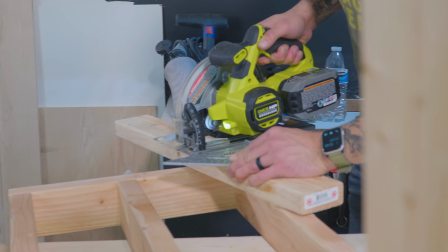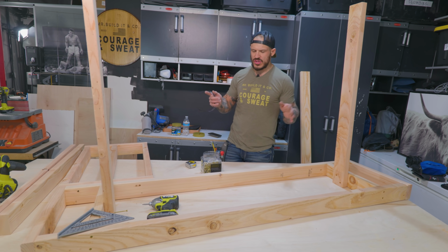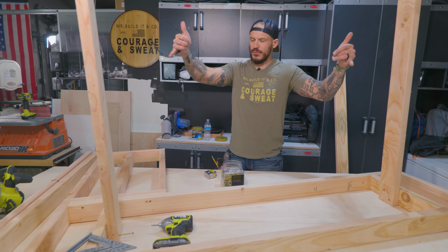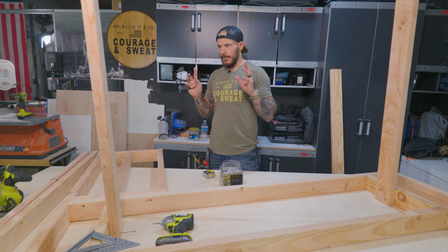This is the base, 6 feet long, 4 feet wide. The inset for your knees, about 8 to 10 inches. I'm going with 9, splitting it down the middle. Gonna build this base, put some posts up to 42 inches tall, and then reinforce it, and then we're gonna wrap it with 1/2 inch plywood.